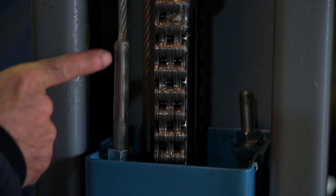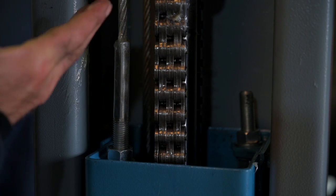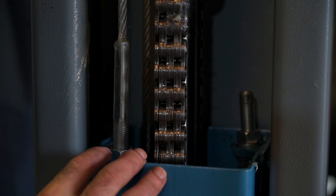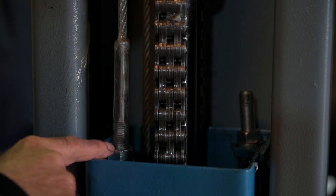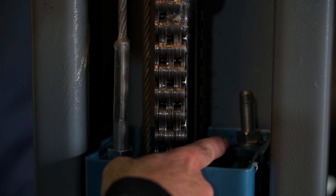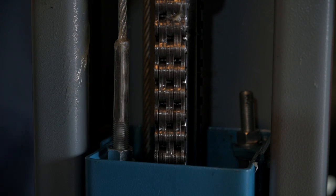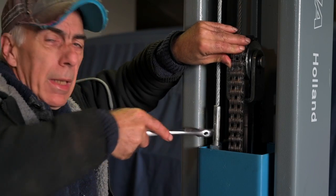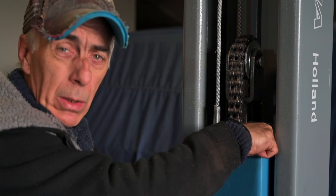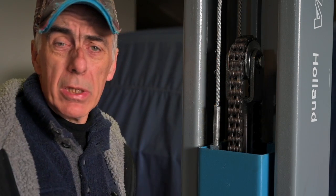On the shuttle you see a pulling cable going up — this shuttle will be pulled up by the other shuttle on the other side. This side of the shuttle is lower by about one and a half centimeters. We need to move the shuttle up by moving this nut upwards about two centimeters, and at the same time release the cable in the back by two centimeters. The shuttle which is too low has to go up, so shorten the cable going up and make longer the cable going down, then tighten it all up with the right cable tension.